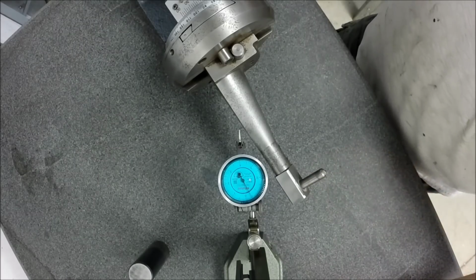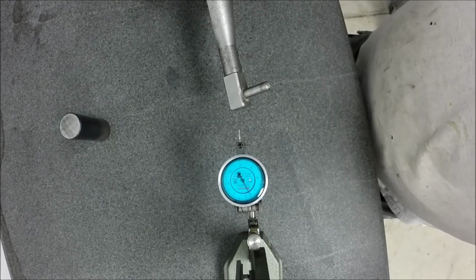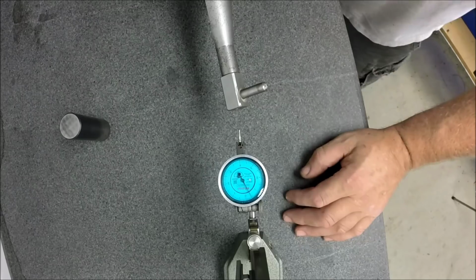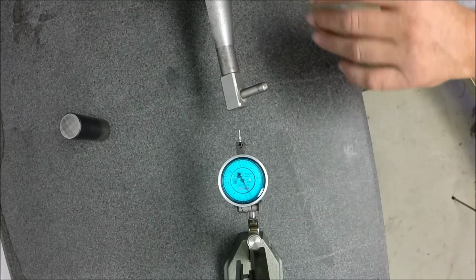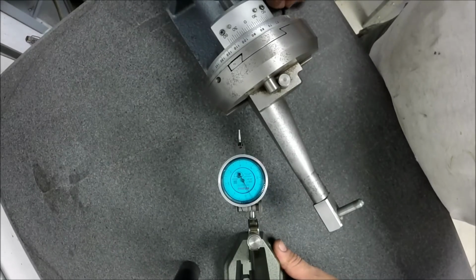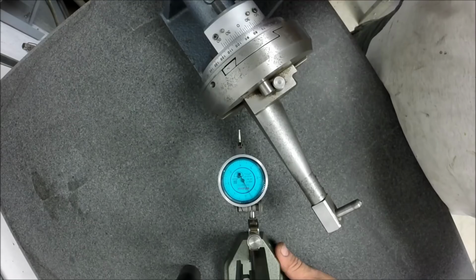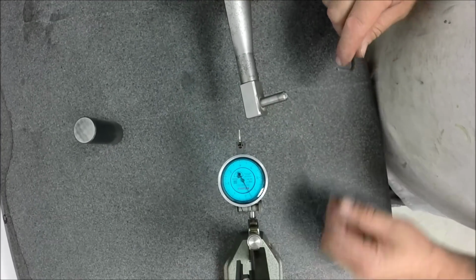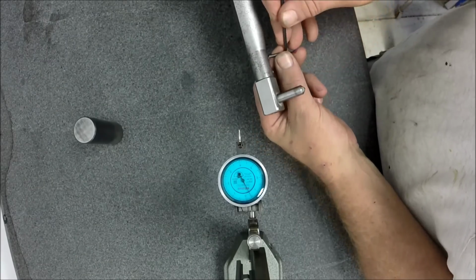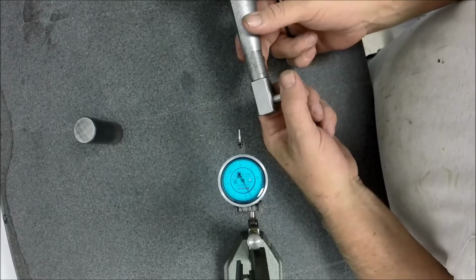I had it at a funky angle and was doing some other crazy stuff with it, and as an exercise, I'm going to show you how to set it at 0. Right now this thing's way off. I have this thing clocked at a 45 and extended. Anyways, we've got it set up at 90. Use the vernier, get it right at 90. The first thing we're going to do is at least get our diamond in the ballpark. We want to get this basically flat, and we're going to indicate it to get it flat.